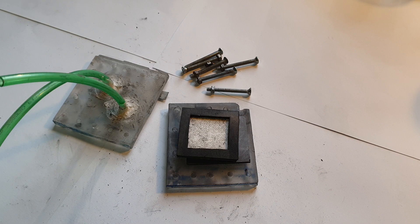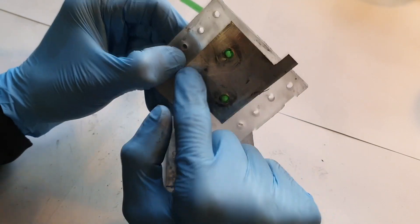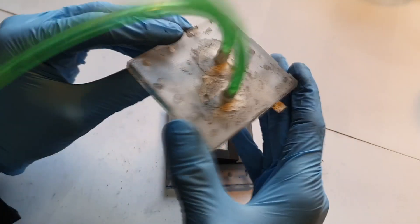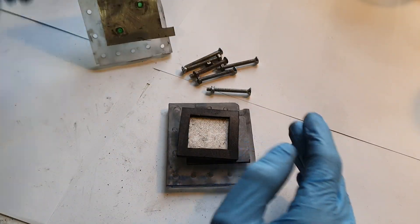Now I will show you this really basic design to make a semi-flow zinc bromide battery. I will start with the negative electrode, which is made from an acrylic plate — this is basically the end plate of the cell. Some zinc plate is glued with silicon sealant to the acrylic plate, and at the end I make two holes for the electrolyte to flow in. To these two holes I also attach pipes, and I seal everything with silicon sealant.